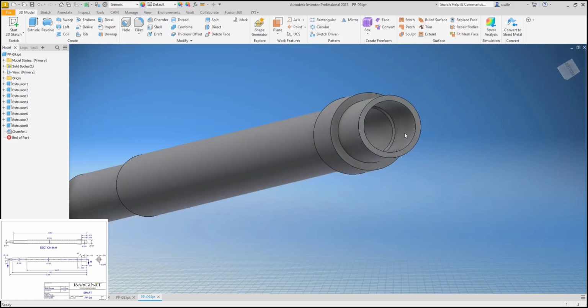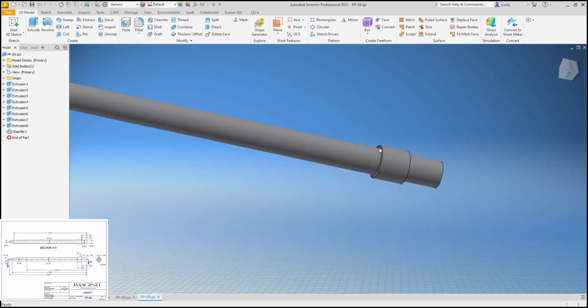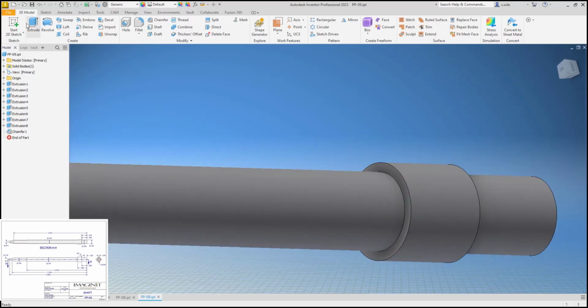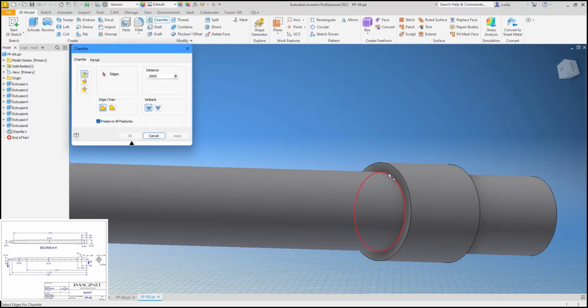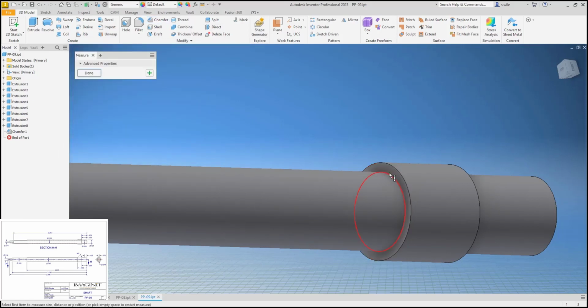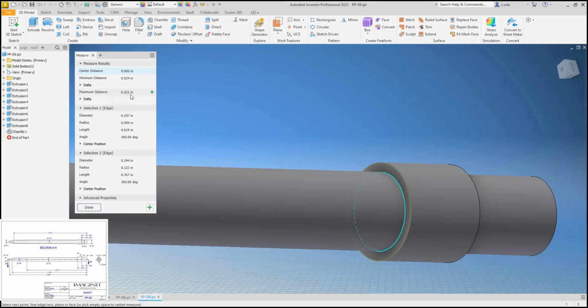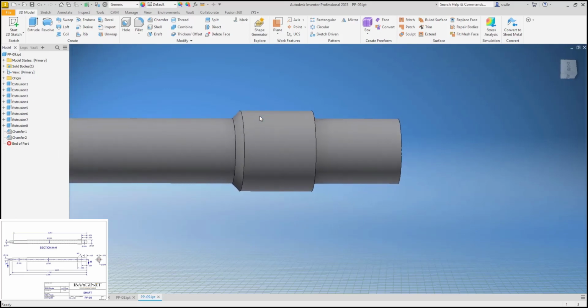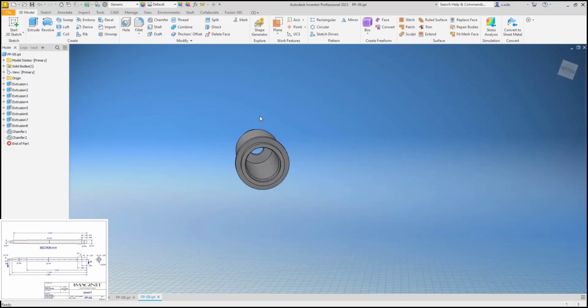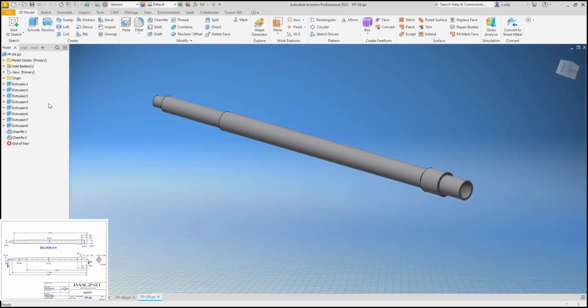So that's my chamfer there, and then we have a 45 here, whatever this distance is. So if I measure there to there, 0.024, 0.024. And again, it failed, so I'm going to guess there's a precision thing happening here. So let's change my precision. So 0.0235, 0.0235. All right, that was probably the long way around doing that. Maybe a couple revolves, 3 or 4 revolves might have been a little bit faster.